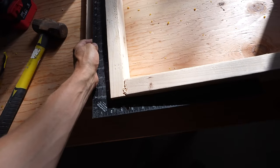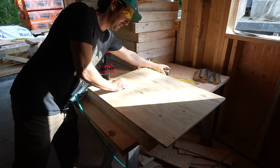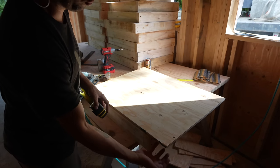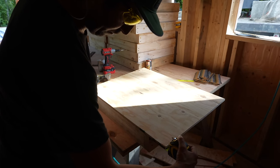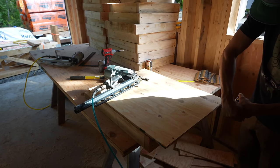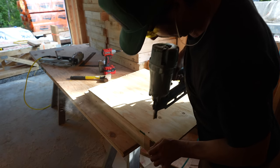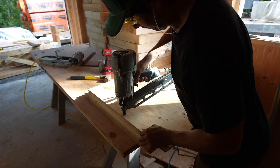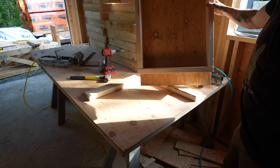And before you nail the plywood, you just check that it's nice and square. So we're gonna lay our plywood on, like so. And we're gonna get our plywood all lined up, squared up, and pop it into place. The bottom of the plywood needs a 4-inch overhang to grab the wall below, tie everything in really solid. So that's why there's an overhang on it. Before we pop it in place, we'll just double check that it's got a 4-inch overhang. Should be about 4-inch overhang. Our truss block right there.